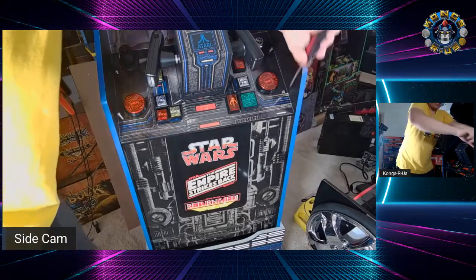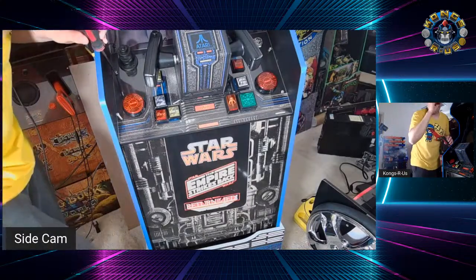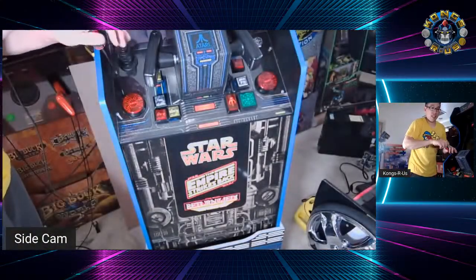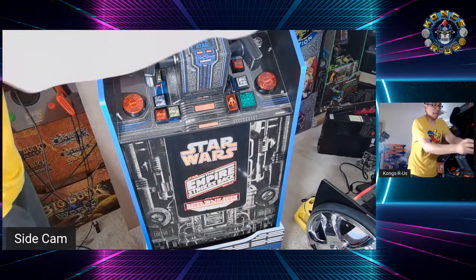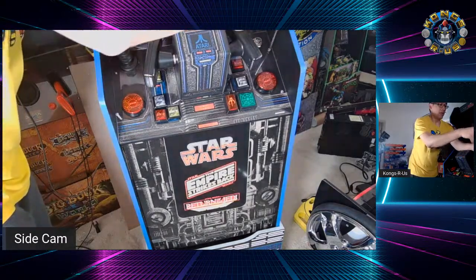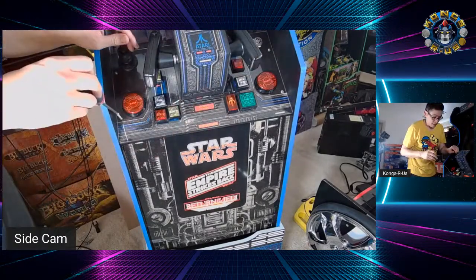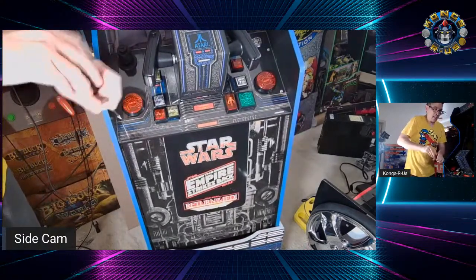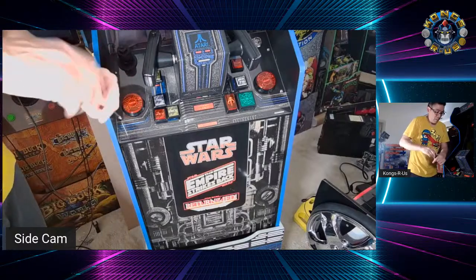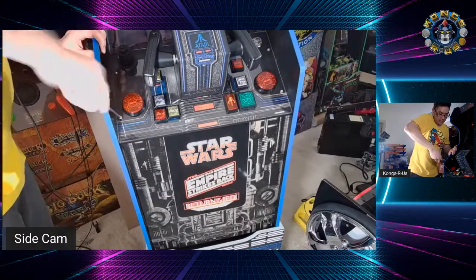For the playlist that I run, because I want to run Sega Model 3 and Technoparrot games and things that use a little bit more power, I do recommend having a dedicated GPU instead of using the onboard graphics card. If your goal is to just run MAME and classic games, like the original Star Wars Trilogy arcade game, you can get away with just using the integrated graphics card. But if you want to run Star Wars Trilogy on Model 3, or any of the console games, or Technoparrot especially, the minimum graphics card I recommend is a GT 1030, and beyond that, I'm using a GTX 1050 Ti. My most preferred graphics card, if you can get them, is a GTX 1650, low profile, because those are the ones that fit inside these business PCs that I use.